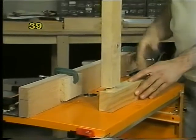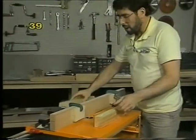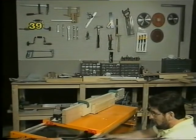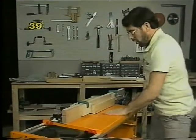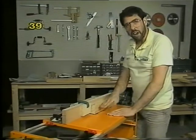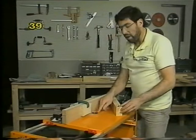If it wasn't a perfect fit, you could reset the blocks and go through making it a bit deeper. Do it in a series of passes — this is a good way of seeing how deep you're going. Raise the cutter until you've got another 5mm of lift. When making multiple mortise and tenon joints — you might be doing eight, for example — don't keep going up and down with your router cutter. Do all eight pieces at each of your router cutter settings.